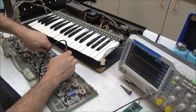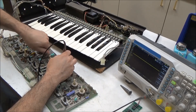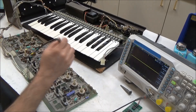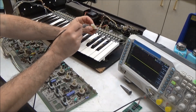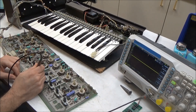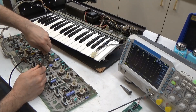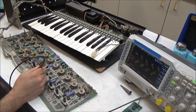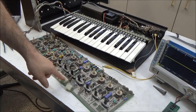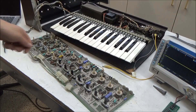Now let's go ahead and take a look at that control voltage node — pin 3 on the ladder filter transistor array. Let me turn the cutoff frequency knob, and we can see the control voltage is now moving, whereas previously it wasn't. So let's go ahead and take a look at the pin for the audio output — the shielded cable, the black wire, goes to this pin on the connector. There we go — turning the cutoff frequency and there's our original signal. If I put this board back in, I would expect to get audio output now. So I took a jumper wire and connected this audio output connector to the high output jack.